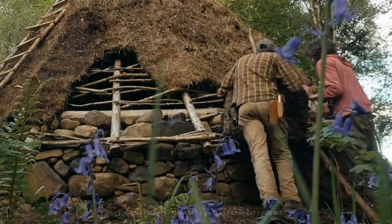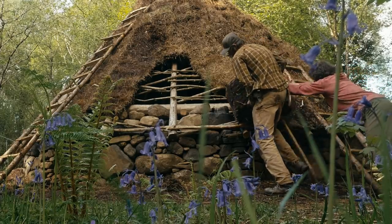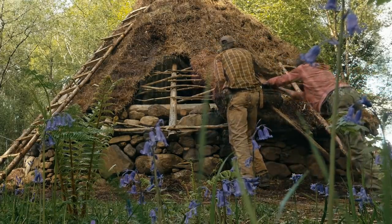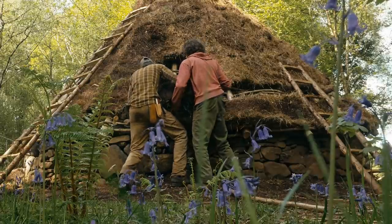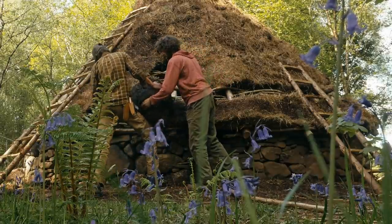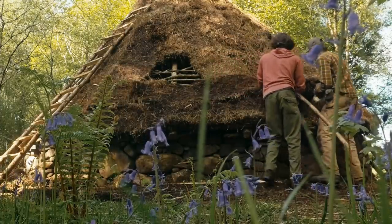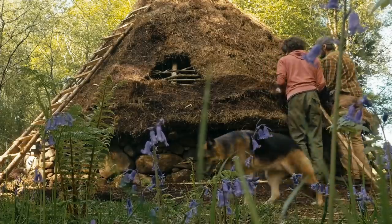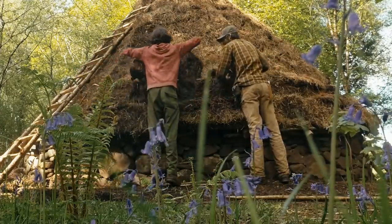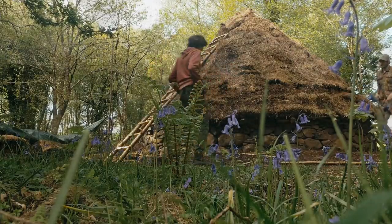Okay. These scraws were harvested from the bog, seen in episode 11, and form just an underlayer on our roof. Therefore, they don't have to shed any water. The orientation in which they are laid is not so important, as long as there are not too many gaps in between, and they lay relatively even over the roof. They should fulfill their function, on which later more.